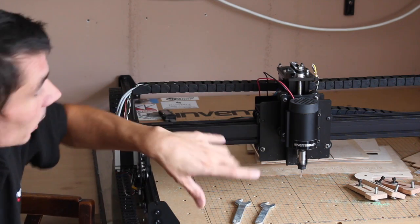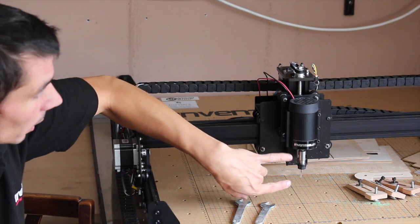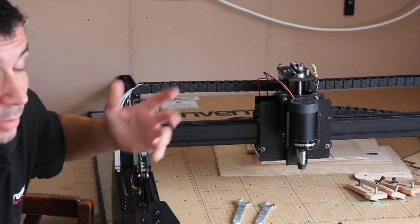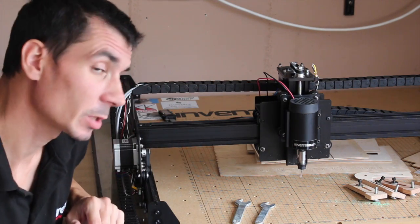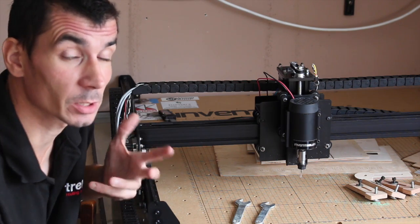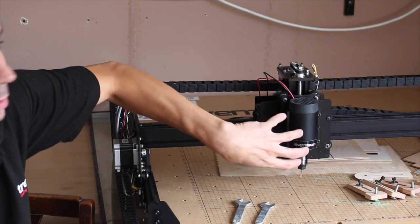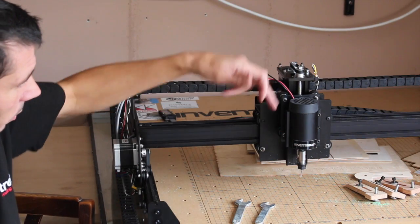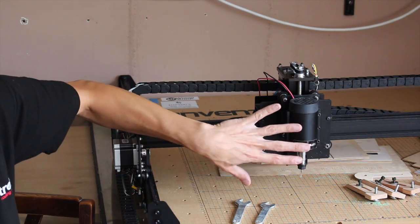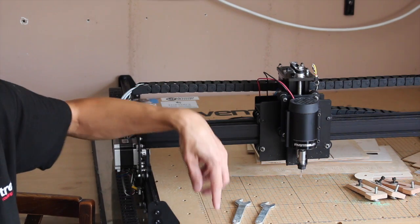The one thing I don't like about it is the fact that the actual spindle is quite long from the bearings to the point of cut. I mean, that's nearly, it's getting on for 3 inches, between 2.5 and 3 inches. So there's a lot of potential deflection there. So I'm not 100% sure how long the bearings are going to last on that. It is my intention to upgrade the spindle. The home point on the wasteboard, when the spindle is across, it doesn't actually meet that. Obviously it's quite a small spindle, so by putting a larger mounting on there, I think that's going to run